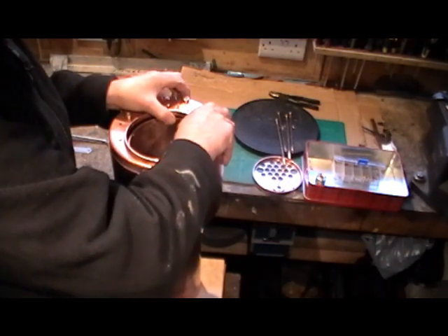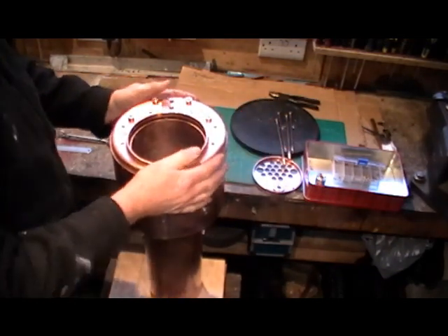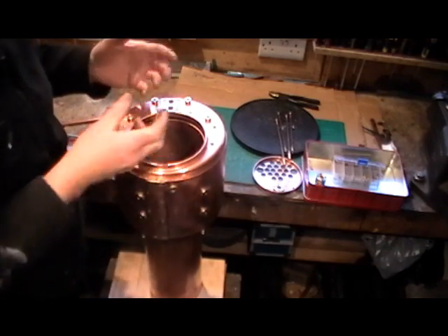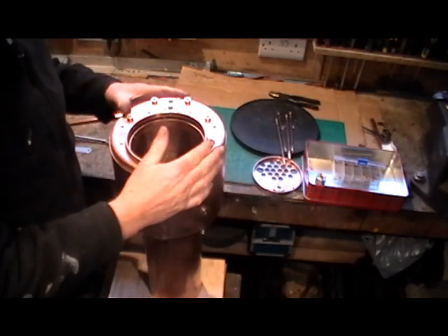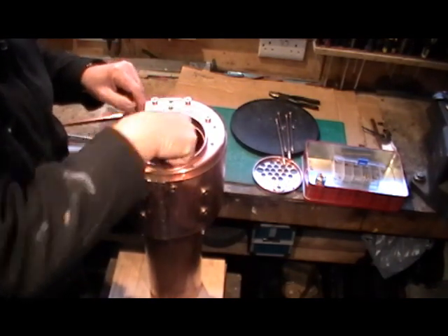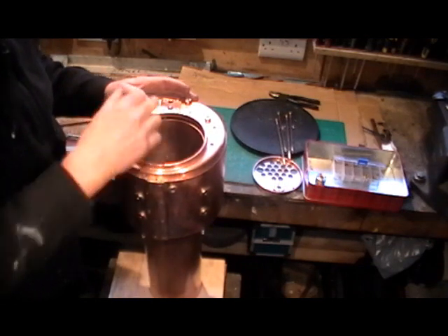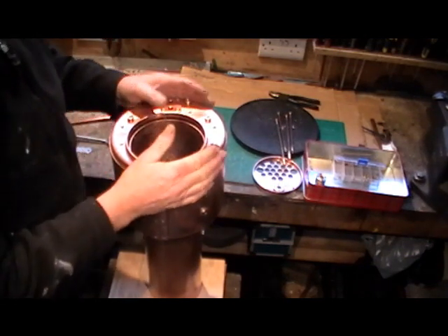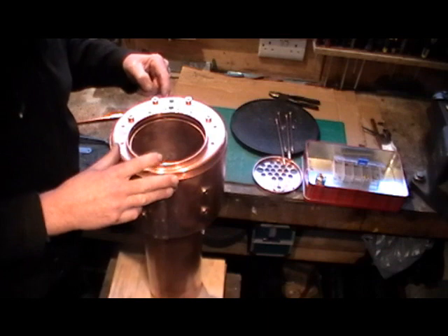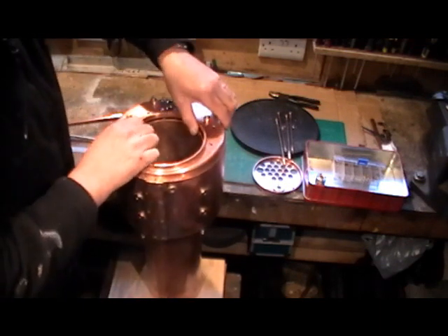It's a really good fit because it's got to be — it's going to be soldered. I'm not going to tap it on just yet because once you tap it on you've got no way to grip it to pull it off. I've already tried it without the inner firebox in, so I know it fits. I've put centre pop dot marks in all the positions so I can line everything up correctly.